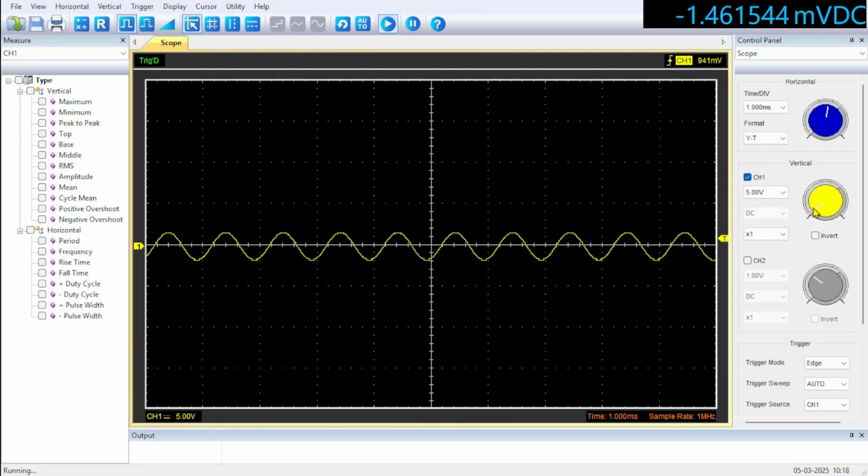Now what you can see on the top right is the DC voltage that I'm applying to the input of the scope with a sine wave superimposed on it. As you can see on this scope, you can do times 10 and times 1, DC coupled. There is no AC coupling, which makes, on times 1, the scope rubbish basically. If you wanted to look at the output on a DC coupled amplifier that's got, say, 3 volts on it, this is one of the problems you're going to have.